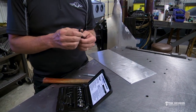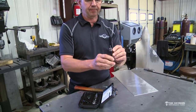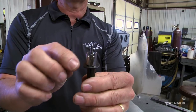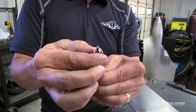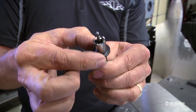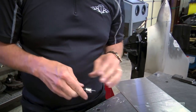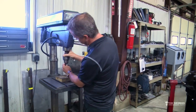The concave washer on here is flipped — rounded this way — so that if we go all the way through it doesn't scar the panel up. It also has a couple of flats on it, because after you use this it's going to try to tighten itself down, and you can simply grab it at those flats, turn it, and break it loose to put the kit back together.